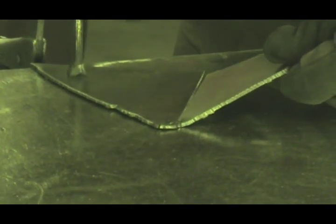See, you can just scratch the rod like this — can you look down here? That's one way to get the arc started. Now look over here on this other end. Let me show you the other way.